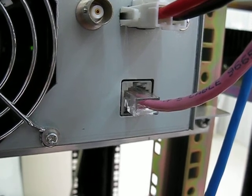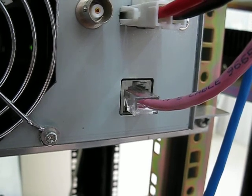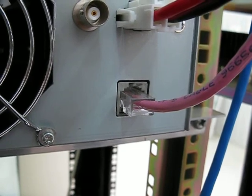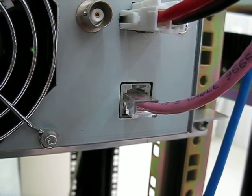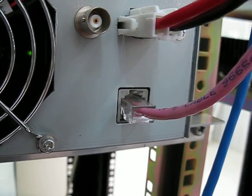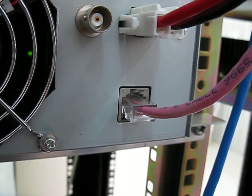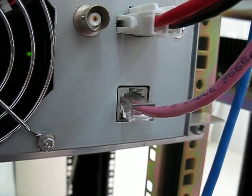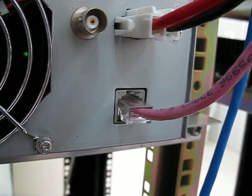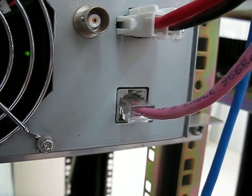This time I'm showing you a simple logic probe that you can build, probably using stuff you've already got in your shack, which will enable you to monitor the receive enable line. I'm having some issues with my repeater, and other people have indicated they've seen this as well. There appears to be a random noise on the receive enable line — the line that goes from the repeater hardware to the controller to indicate there's a valid signal. And after a period of time, it's like there's noise or random triggering, and in extreme cases it locks on.